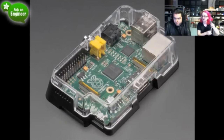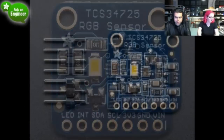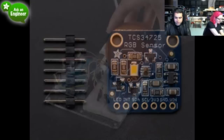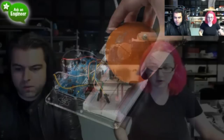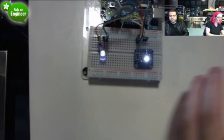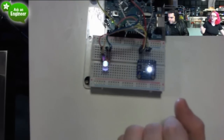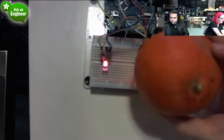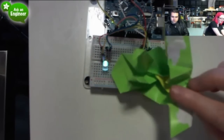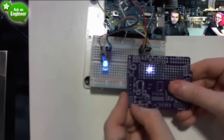Last up: the color sensor. We think it's the best color sensor out there. Here's a picture of the color sensor — when you put orange on top of it, the little LED that's controlled gets its sensor information through Arduino. Let's go to the overhead. So this is the sensor, and there's a white LED. The LED is what illuminates it because the sensor has to have light bouncing off of whatever it's looking at. For example: orange, and I have a piece of green paper here. I have a purple PCB — it's a little tougher to get the purple to show up.